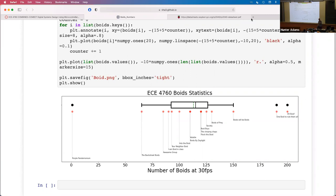The fix would be: suppose we leave one pin connected to ground, make the other a no-connect, and add a pull-up resistor — maybe 10K. This way, when we're in the grounded orientation we get ground going into the GPIO port, and as soon as we leave that contact the pull-up pulls us high. So the voltage on that pin is never floating. This is just good practice — it almost certainly didn't cause any bugs this time, but in a future application it might.